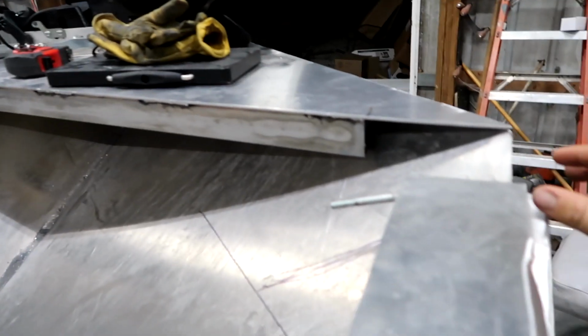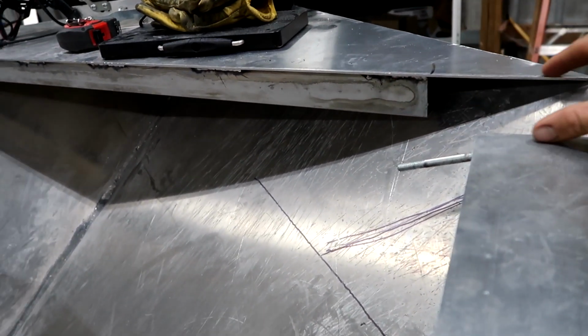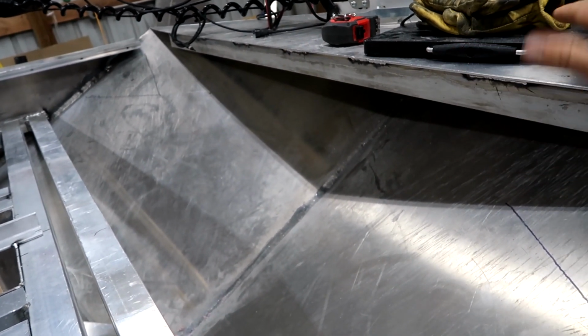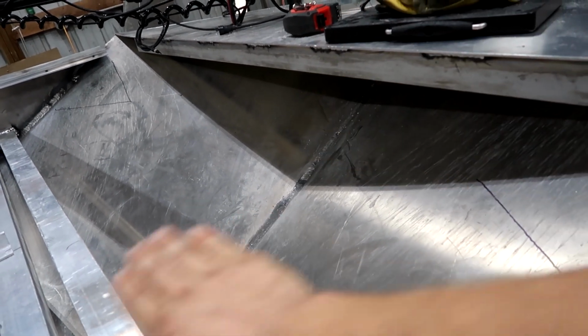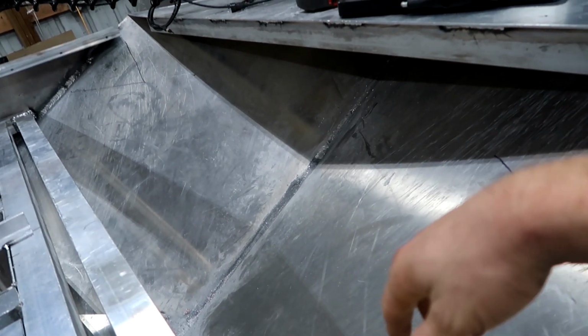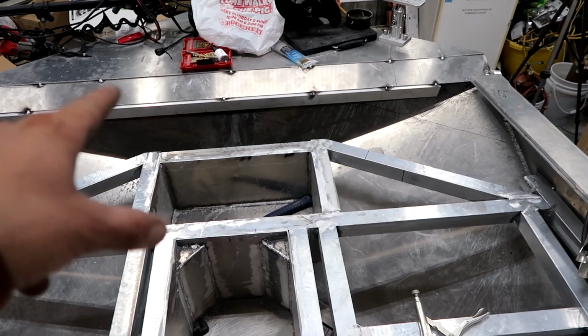So I did that, and now you can see I've got to fill that gap with a rip. So I'm gonna cut that rip and get it squared up, and then from that rip, the boat floor is actually gonna come down to this line right here or somewhere in that area. Then I'll have to have an additional vertical piece to drop down to tie in to the horizontal plane that my floor is making. So that's what was left by raising the front deck of the boat 2 inches.